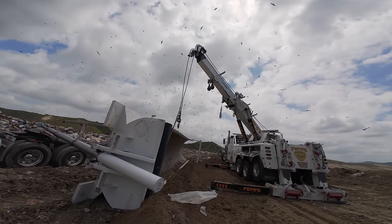So as you can see on this one, the bar here is relatively bent up, and this one's bent down. So in order to compensate and level this out, because even when we lift it, it doesn't hold any weight, it's not going to bend that little arm back. So we're going to use a tall fork and a short fork on that side to offset the discrepancy in height. There you go, Echo.